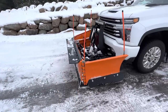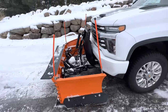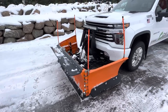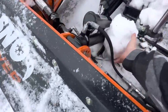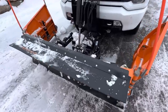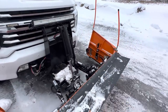They just carry so much more snow. Like a V-plow, when it scoops up, they just don't carry very much. And as far as wind rowing, this blade doesn't turn, but when you put one wing forward and the other wing back, a lot of the snow kicks off the other side. If you're plowing commercial, this F12 and F14 is definitely for you. If you're plowing roads across the lake to get to your fish house, it probably isn't for you. But if you're doing anything commercial — scooping snow and occasionally wind rowing — this plow is for you 100%. It's so nice when you hit something, how this right here will go in eight inches so you don't even feel it in the truck. You're not just pounding your truck. They scrape really good with these wings following the down pressure, and it follows the contours really well — scrapes amazingly well.